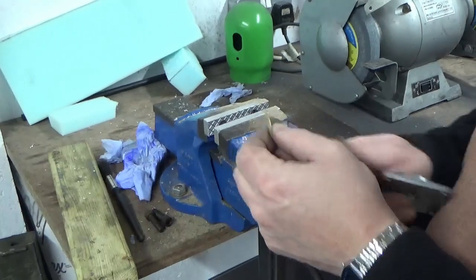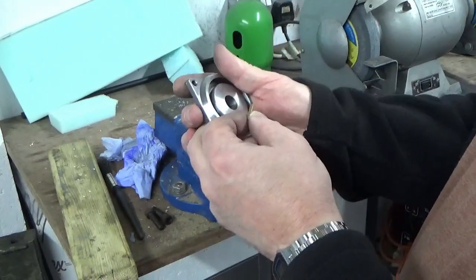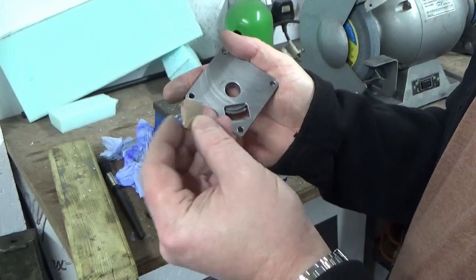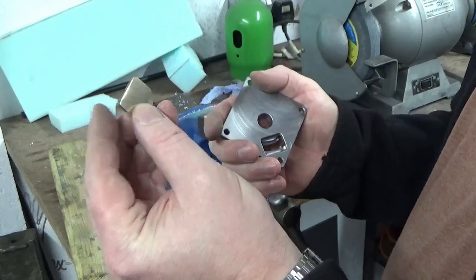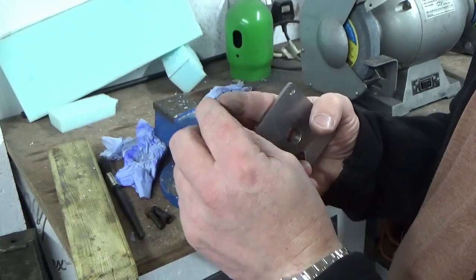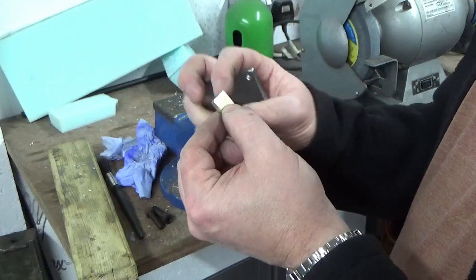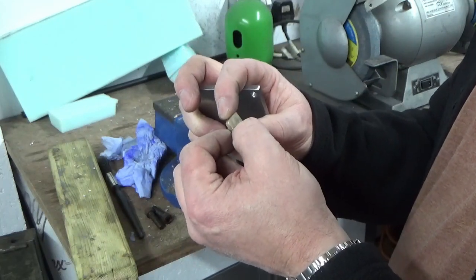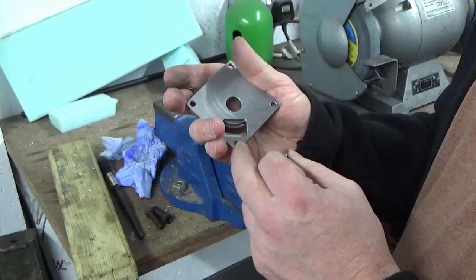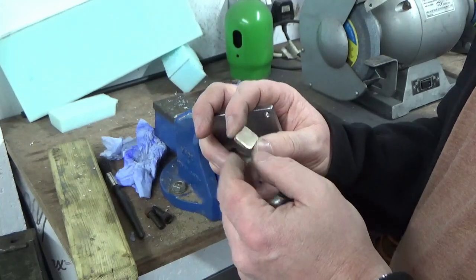Alright guys, I thought I'd just show this as a bit of a tip. What this calls for is a blanking plate in the back. So we've made some out of brass, these are all handwork, nothing other than bandsaw and file to get them down to size. They're a little bit undersized on the width, this is 15.875 and my aperture's 16 to draw in, so a little bit slightly under width.